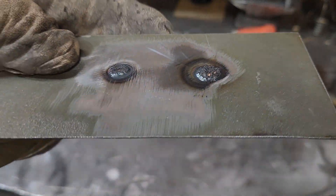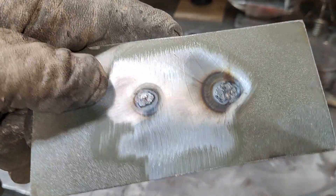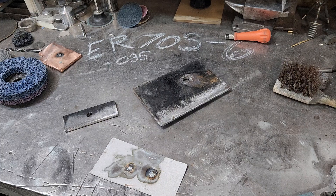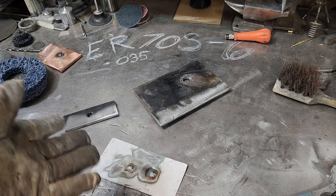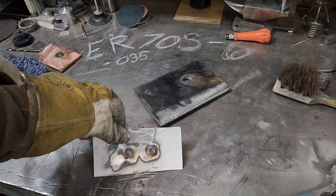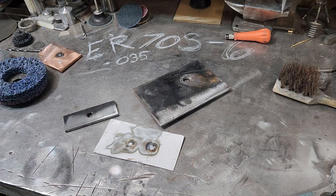You can see the backside — it minimizes warping this way as well, when you hit it directly to that copper because you're not putting heat to the sheet steel. That's why I'm capable of running that .035 with a bigger machine. My brother has a little buzz box so I can't really complain. I would love to have a smaller wire but you work with what you've got.